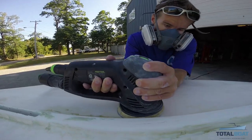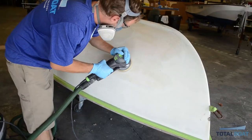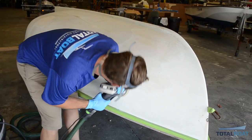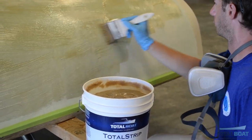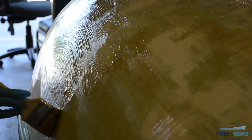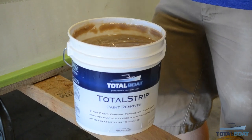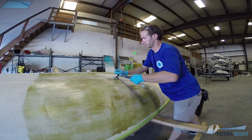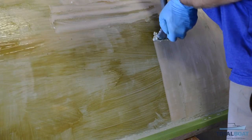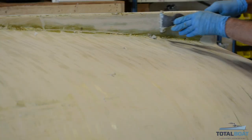Like any project, there's more than one way to do it. On the other side of the hull, we were able to sand off all of the old paint and smooth it all the way down to the gel coat. We realized that the paint buildup along the side of the hull is much greater than on the bottom, so we wanted to speed up that process. I decided to pull out the Total Strip and lay on a quick coat with a 3-inch chip brush. We let that sit for about 10 minutes — that way we're going to be able to strip the paint off faster than sanding, and the sanding process will go much quicker. In the long run, it could save us hours on this whole project.